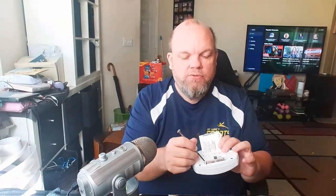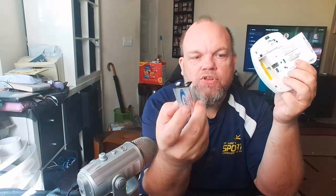In order to change out the battery, it's usually on the back here and they usually require a nine-volt, which looks different than triple-A and double-A of course. That exposes the nine-volt battery, which the majority of carbon monoxide detectors will have — it's plugged in by two different ports. Let's go ahead and pop this out; it slides out basically. So a nine-volt looks like this.